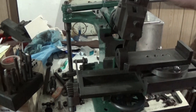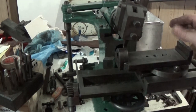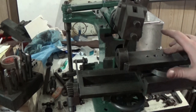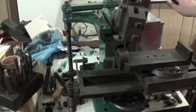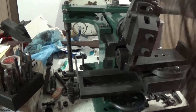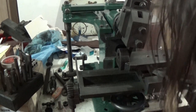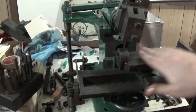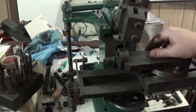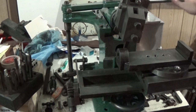So we use the down feed until it just touches on, and we're going to mess around and probably run a cut through there, and hopefully when we're done this will be nice and flat and parallel. Feel that it's not touching in the centre there, it's only touching on the outside edges, so I think that could have a little bit off it. To clean that up, if I take 3 thou off there's going to be plenty.